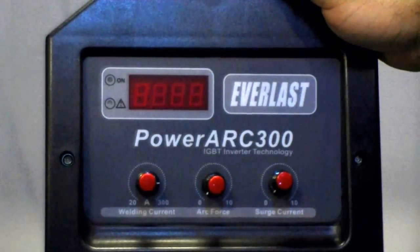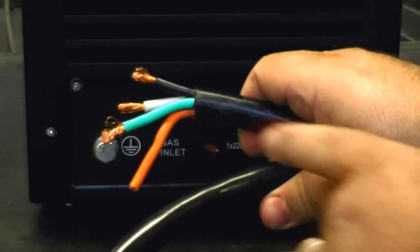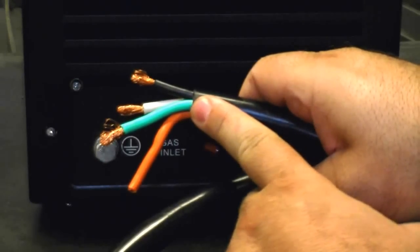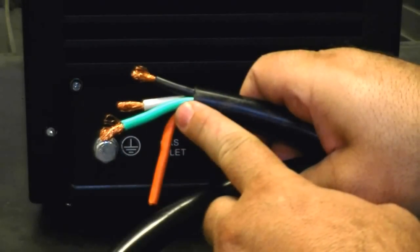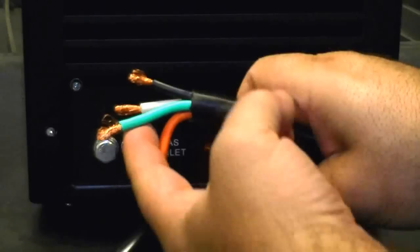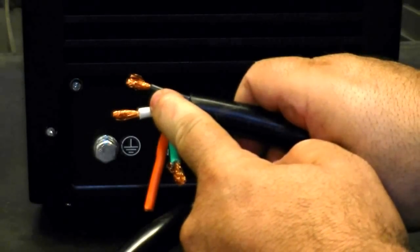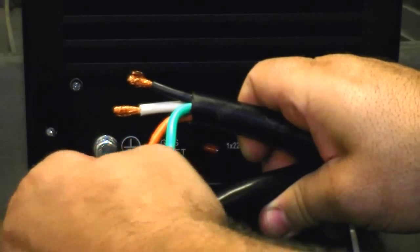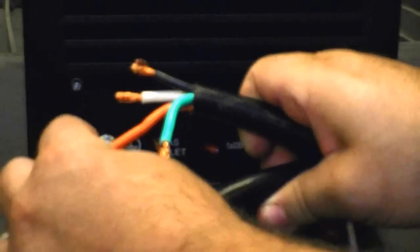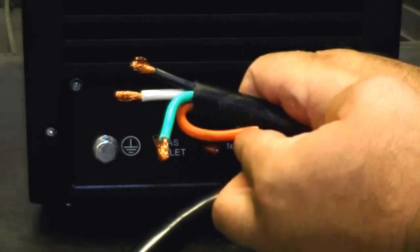All three of these features are commonly found on high-end welders — this is a very capable unit. It will meet anybody's expectations on any type of material. Your welder is going to come with three wires, and none of them is a neutral. In a welding system on single phase 240, the green is always going to be your ground. White and black are going to be your hots. We have an additional reddish-orange wire, and this is going to be for three-phase 240 operation. If you've got single phase, don't let this wire intimidate you — all you need to do is either clip it off or tape it up out of the way.